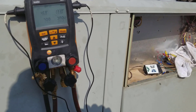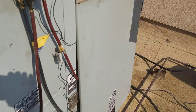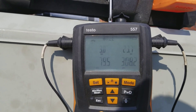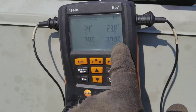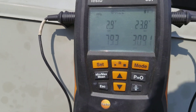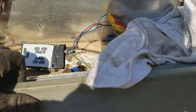Just got done starting it back up and it looks like it was a major success. Right now my pressures — I'll put them on screen also — the high side's a little high, probably because the panel's letting some air bypass the coil and it is hot, but about 310 or so, over 80 suction. When we switch this to superheat and subcooling, subcooling reads real high, but that is also because this is on the discharge, it's not on the liquid. This unit does not have taps for the liquid line, so that's going to read a little higher. 79-80 psi, and my superheat keeps fluctuating — now it's actually showing really low, like 3 degrees superheat. So yeah, it's not restricting.